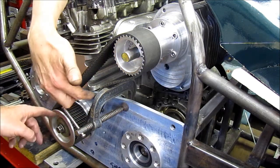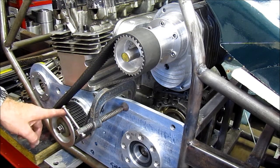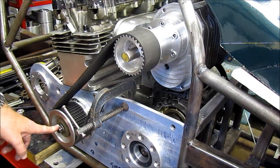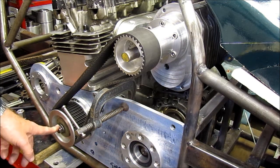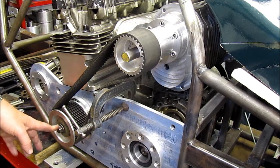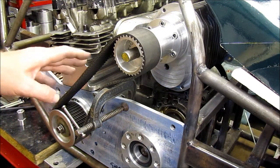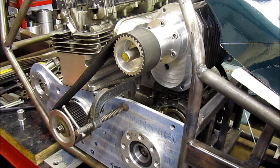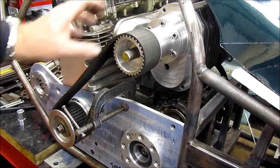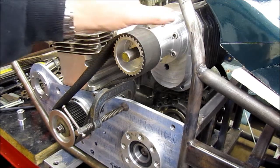We can work out the centre point. There's still some work to do on the mount for this end, which we're going to use an alternator stub that we've machined ready to go into our top hat. It's got to be pressed in and welded, and then that can be drilled to suit the pulley. But there's something else that's got to be done yet, and that is that there's an issue here with all the tension and torque that's going to be on this top pulley here, wanting to pull it down.